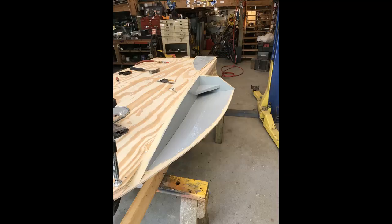This slide shows how the sponson inner supports are fastened in. They are the strongest part of the sponson, so you want to make sure you get them well supported. The triangular gusset in the back is my addition — it's not in the plans, but it stiffens the transition from the back of the sponson to the edge of the sponson and gives it a little bit more strength.